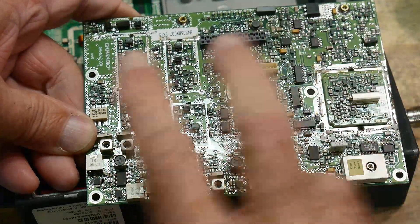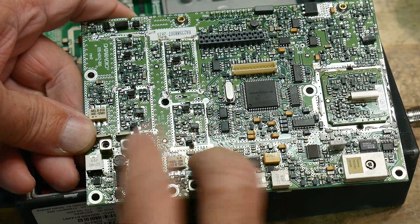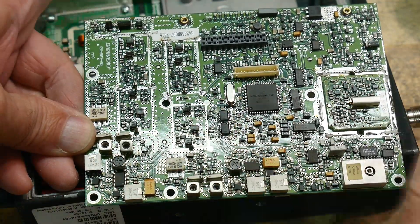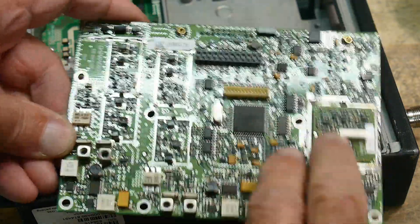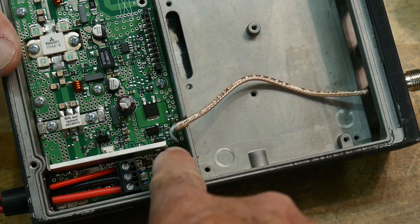So if you get any multi-path phase noise that cancels off the signal, by having two antennas you can figure out which one you should be listening to if you have two different paths. The two antennas have to be separated by some distance for this to work — that's why there's two paths. And then the transmit section comes out this connector here which bolts to that screw down there.